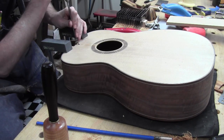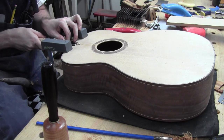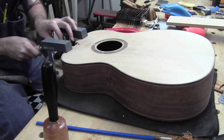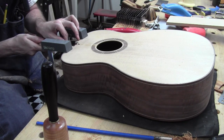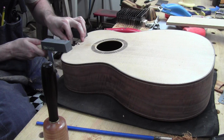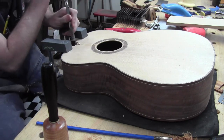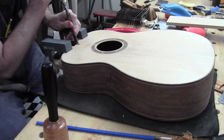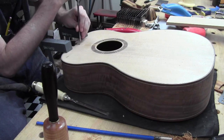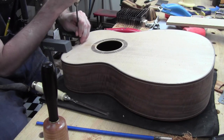And I think I'll try to mark that area with the downward side of this, and we'll just widen the slot down here. That's all we'll do here. Yeah, we'll use the wider chisel to do the widening. How about that? So it'll be at least somewhat square. Okay, so that's there. Now let's see if we can pare a little more here. Don't want to do too much because I've still got to sever fibers up the hill here. Try to do a clean job of this if I can.